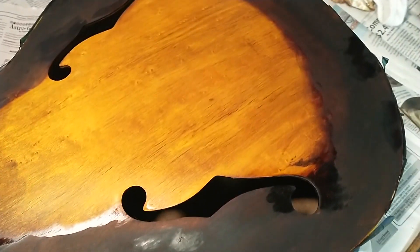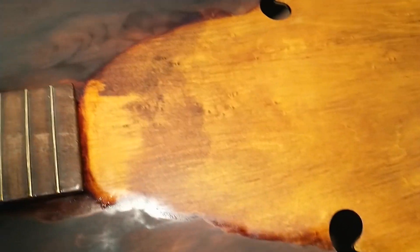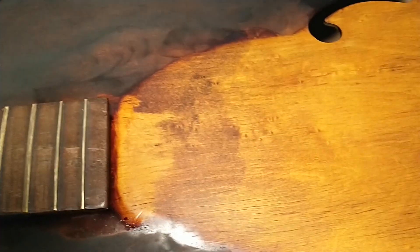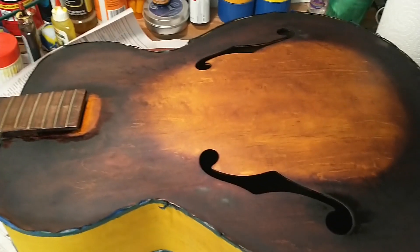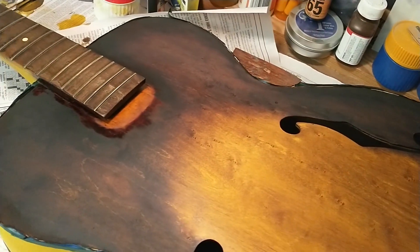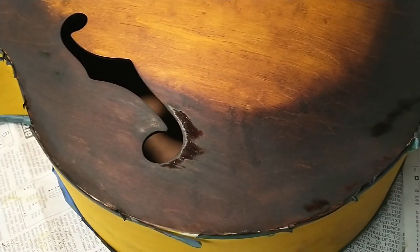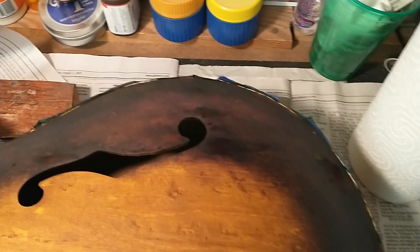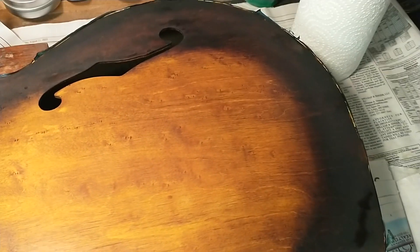As I'm progressing, I'm having some real challenges. That right there is due to fire damage — the dark stain got into the dark spots and I'm not sure what I'm going to do with it. In the end, I spent a lot of time and tried some different things. I used a cotton swab to apply heavy amounts of dark dye on some of the spots that were not accepting the dye.